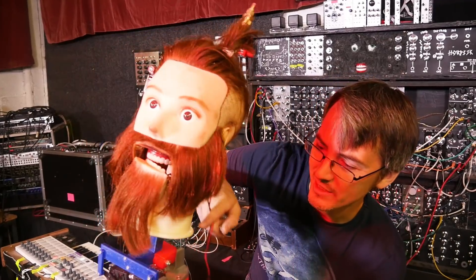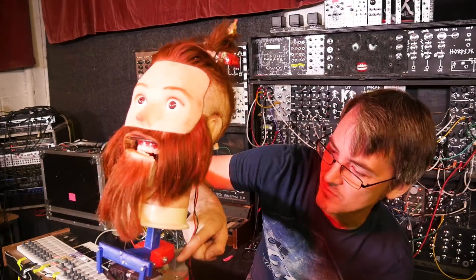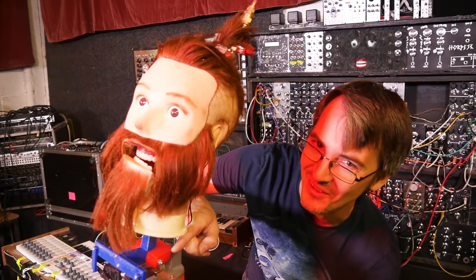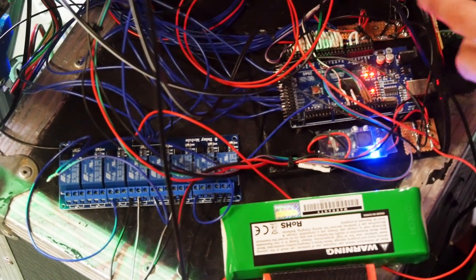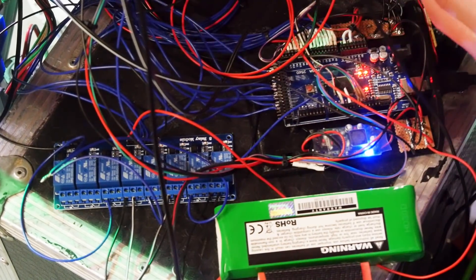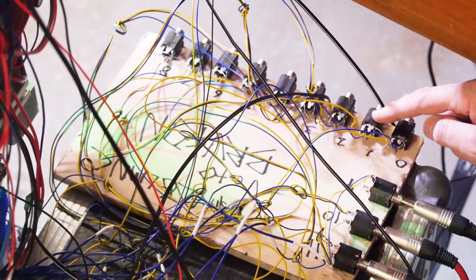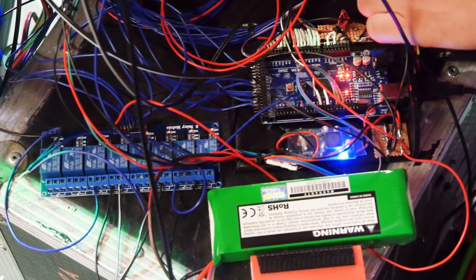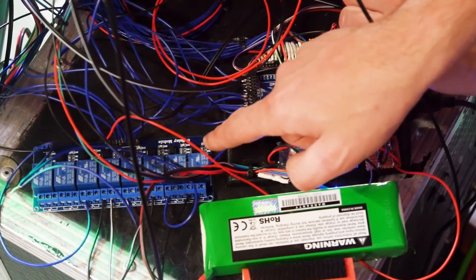We've got an axis on the head to move it sideways using the servos — one goes plus and one goes minus. We've got another one that rotates it, and one that moves them both up and down. Those are going to be synced to drum notes, so his head should go crazy when the music's on. We've got our Arduino Mega here with a voltage regulator, some batteries to power it, and a relay board. We've got 12 analog ins that go to the analog ins of the Arduino, extended out to these jacks. Three are plugged in to the drum pads at the moment. If I take channel 9 and simulate turning that knob — a 0 to 5 volt signal — it should open the jaw and make the fire go off.